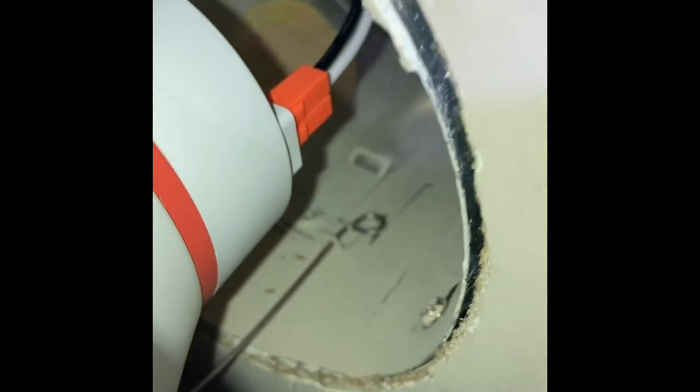The wire connection is plugged in, and then here are these little springs. They're sitting in the original hooks that the old system used. Use the exact same ones. Just pops right into those, and then as you can see there, I kind of boogered up the ceiling pushing these cans out, and that's typical. I mean, they put so much plaster, and this drywall just comes apart. You can get some spackle and fix it if it makes you feel better, and maybe some paint. However, these trim rings are big enough that it will hide my boo-boos here, so I'm just gonna push it up at this point, straight up, and that's pretty decent. I do have a little bit still showing there. Nothing some touch-up paint and a rag to clean up my muddy handprints won't fix.